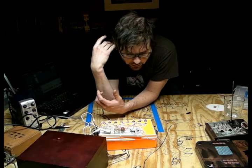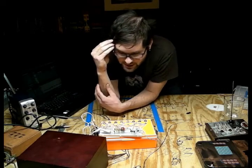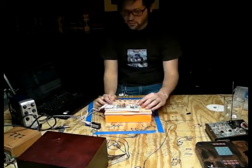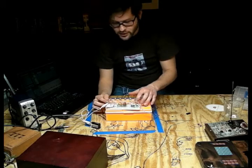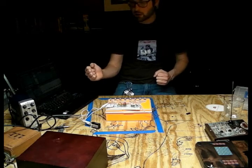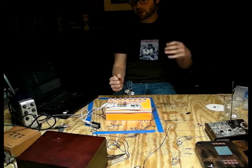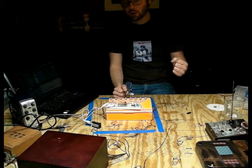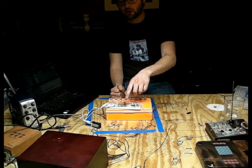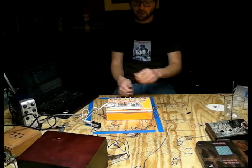I'll probably try the Vactrol, just because it's less time consuming. But yeah, basically one leg of the pitch resistor is all in the same connection. So you would have one end of the pitch resistor in the toy that you've yanked out, and the other end would be that common tethered point, so that every time it receives a voltage, it'll both light the LED and send the voltage to make the connection between that one resistor and the common connection.